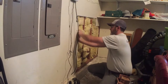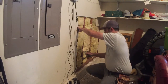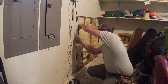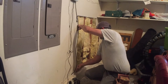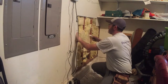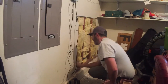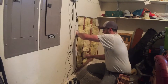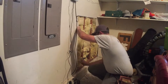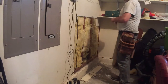I score the front of the sheetrock and now I'm just breaking it and checking for any screws in my way — there's one right there. Then I'm gonna cut through to the back side of the paper. Never cut towards your arm. There we go. Two screws. That's how drywall demo goes — you go through blades. Now I've got it cut out.